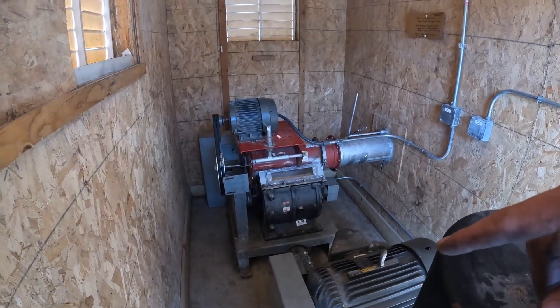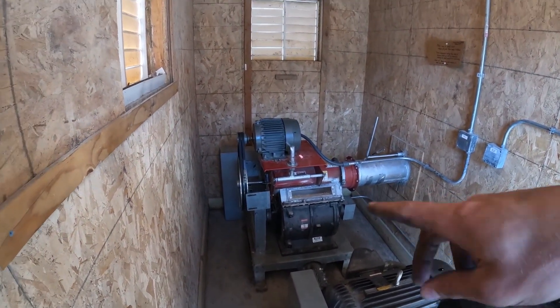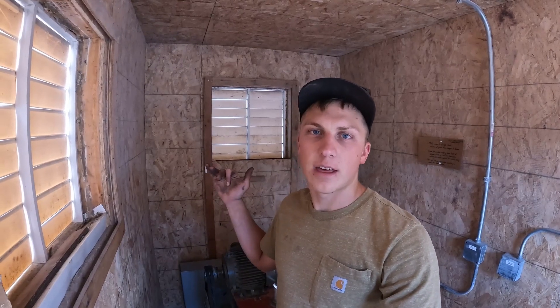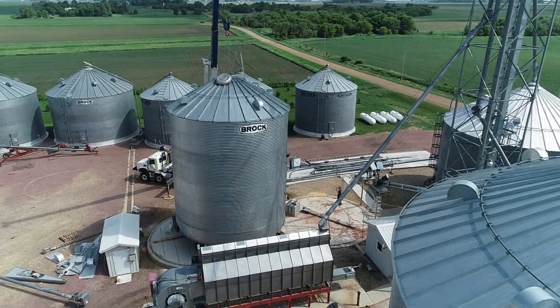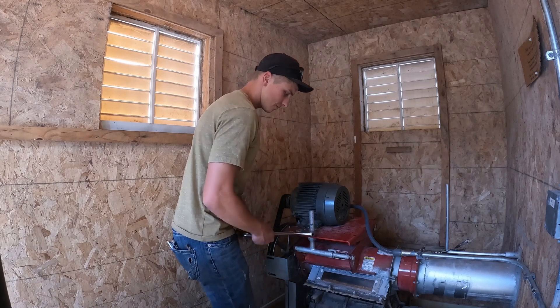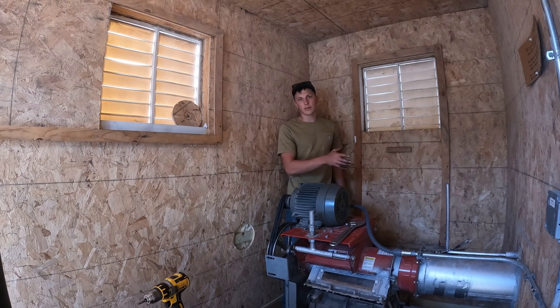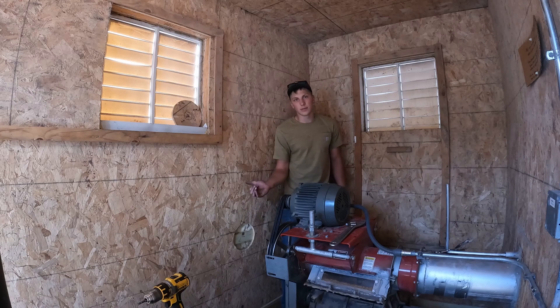I came to our blower shed which houses our blower and the unload for our dry bin, which takes corn out and forces it through those pipes outside. I noticed that this pulley here doesn't run true. We're obviously not going to run it like that all fall because the unload auger will chew through the tube. So I'm going to take everything off, pull that flighting out, and see if it got damaged when the bin crew took it out. The only way to get the flighting out is through a hole Dad drilled a couple years ago — we'll take that piece out and some of the steel outside and slide the flighting through.